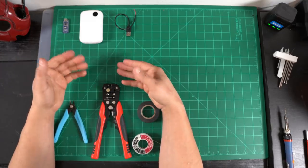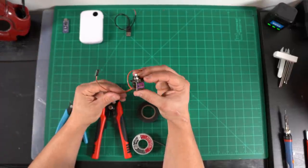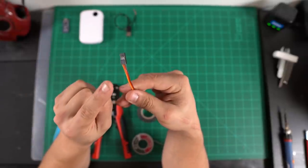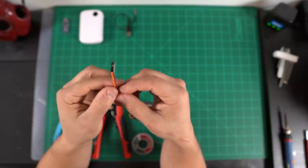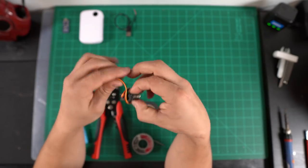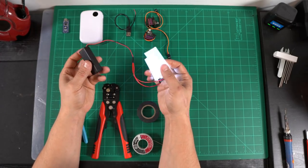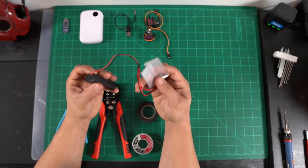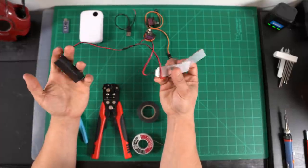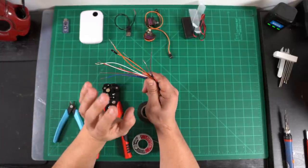For tools, I really suggest a wire stripper because we're going to be dealing with small, delicate wires. You'll also need something to cut wires, electrical tape, and optionally solder. For preparing the board you will need a soldering iron and some solder. Now we need the things we're going to add — like the LEDs and the servos. These are the same MG90 servos we hotwire and modify — it also works with SG90 servos or really any servo. These servos have three wires: brown is negative, red is positive, and orange or yellow is the signal wire. Make sure these are normal working servos that haven't been modified.